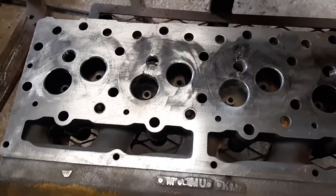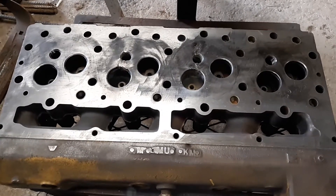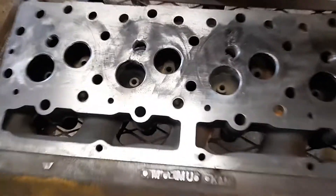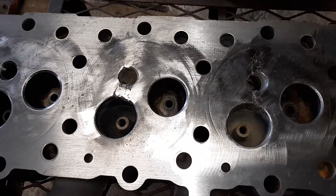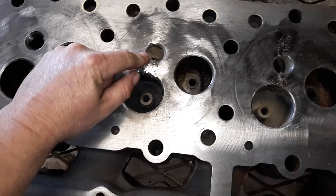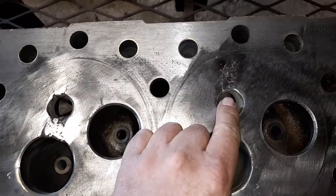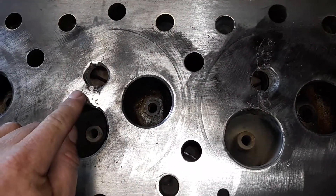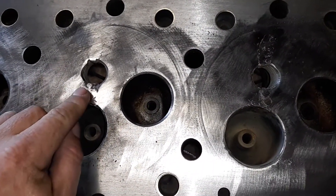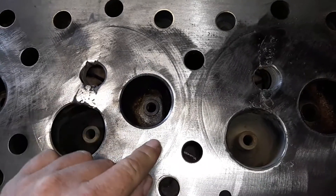What you're looking at here is a diesel head for a loader that has been cracked and needed to be repaired. What happened was the glow plugs got left on in this area and it cracked these areas of this head pretty deep too, and it was brought to me to be welded and repaired.